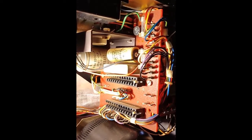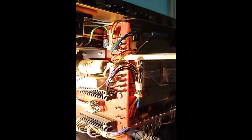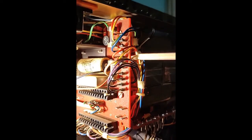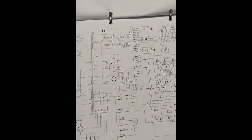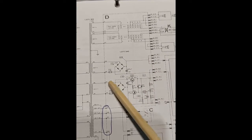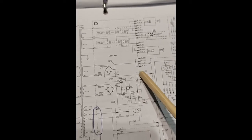This is what I learned. This board gives one line of 21 volts and one line of 27 volts. These first two plugs are 21 volts. Then we have five which are zero volts. And then we have four plugs which are 27 volts. We can see this from the service manual also — the 27-volt line with four plugs, the 21-volt line with two plugs, and the four plugs with zero volts.